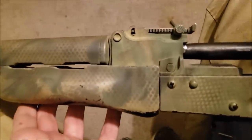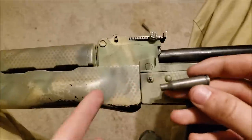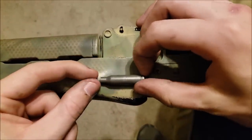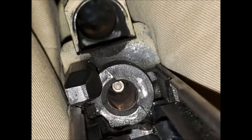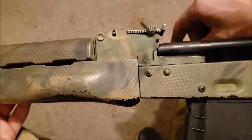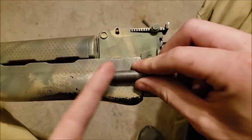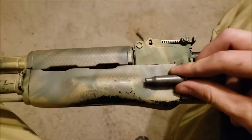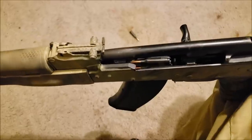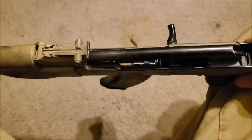The squib could be caused by two reasons. The instance where I had a squib was that the factory ammunition bullet was just a little thick for my chamber — a little tight. I went to chamber the round, and when I went to extract the dud, it pulled the bullet off and left the bullet in the throat. Normally that shouldn't happen, but it can. More likely what happens with a squib is you have a case with no powder in it but the primer still works. So when you pull the trigger, you might hear just a click, an odd pop noise, or maybe nothing at all. But the primer kicks that bullet into the chamber, just not far enough out the barrel. It's one of those serious, deadly things — especially on an auto-loading weapon, it might be easy to totally discount it.